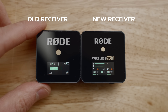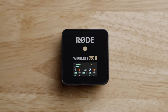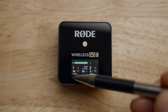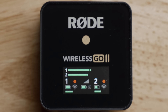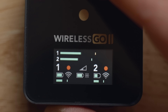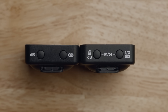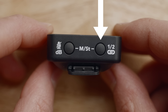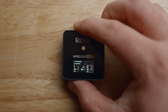Moving on to the receiver, a lot has changed. This newer version has a lot more information on the screen. In the top section we can see master audio levels, followed by status indicators for each transmitter — transmitter one on the left and two on the right. Each transmitter section shows a red record status, battery level indicator, connectivity, and a tiny level indicator. In the middle of the display we have our pad or DB level, which can be toggled between three settings. The button on the left adjusts output levels in three steps. The button on the right allows you to change which transmitter to mute, and once selected you can press the mute button to mute that channel.